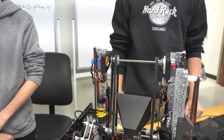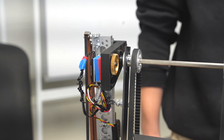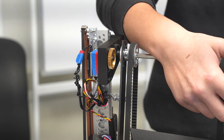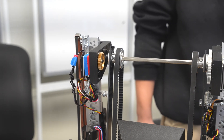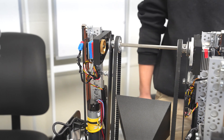We found that we needed a small amount of tension on both ends of our wires to aid in the spooling action. To accomplish this, we simply added some anchored springs on both ends. Since the wire itself is always under a small amount of tension, we were sure to add servo clips on our connections and tension relief loops on high-stress areas.